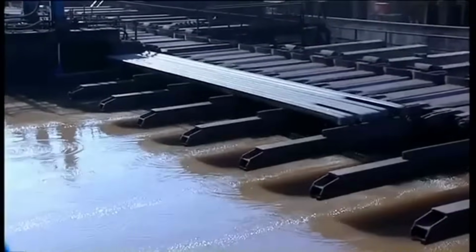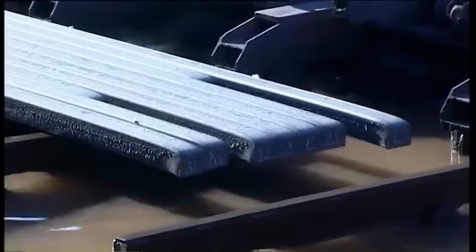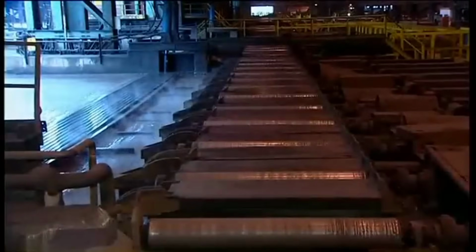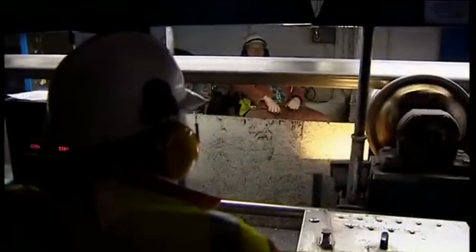Subsequently, the steel moved to water-filled quench tanks for temperature reduction, preparing it for further inspection processes. From here, the steel had multiple routes available. Slabs primarily went to T18 for visual inspection, while higher-grade material underwent automatic inspection, distinguishing between various qualities like tire cords and forging grades.